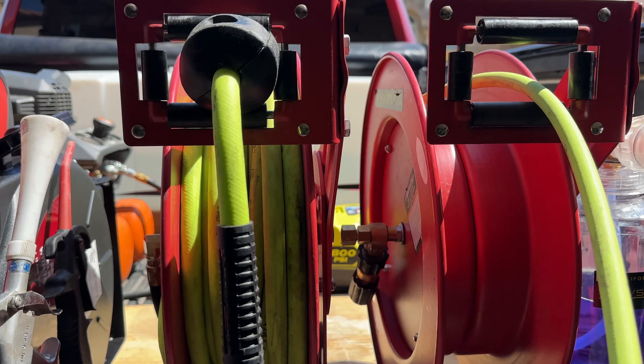Next up — I got a brand new 50-foot extension cord reel. This one is a Husky 50-foot, I think it's 14 gauge, and it's got three plugs on here. This is going to be everything that you need to run anything light off of this extension cord reel. You're not going to be able to run like a steamer or anything — that's going to blow the circuit out. It's only 13 amps. But if you're just going to run your vacuum, a little small stuff — like you can run the Maxshine handheld blower off of that. I'm not sure about ozone machines; if somebody knows how many amps an ozone machine pulls, let me know down in the comments. I needed a new one because the Flexzilla one I had — the teeth broke and I had to keep pulling out the cord and tying it in a knot. So I got rid of it. For the same price, I got a Husky, and Husky has a lifetime warranty through Home Depot.